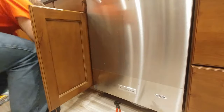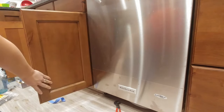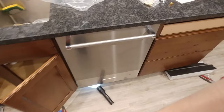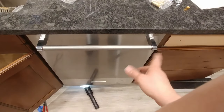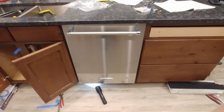We'll go ahead and turn on the water and connect the power — it's plugged in. Now we'll inspect it and look for leaks. It's all looking pretty good. I've got to finish getting mine anchored in place. Once you get this all level you can anchor it in place through those holes that we talked about earlier. On this side I've got a problem because this is too close to my sink, so I'm going to have to figure something out for that. But I think that's the main aspects of it — the plumbing, the electrical, the drain — everything completed.